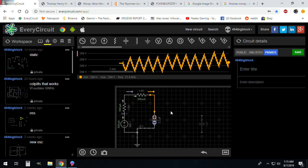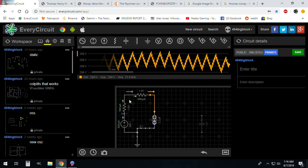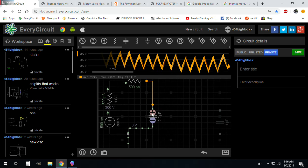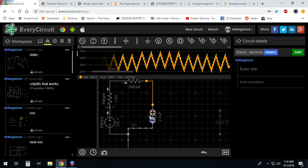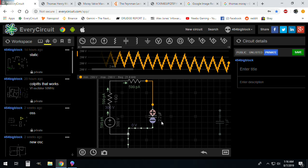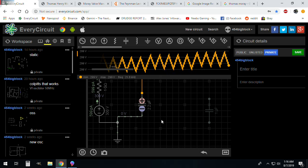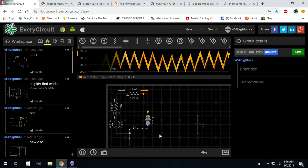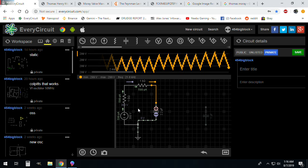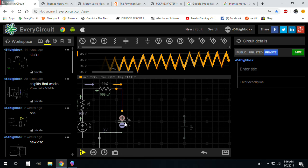Well, that's not accurate, because this amperage is so low. This capacitor here in real life would take a really long time to fully charge up. I think I did some testing and it would take like 30 seconds or something really long for a 2.2 uF at 300 volts. So this is going to take really long to charge, but I propose that we take a fairly big one like this and stick it as the main one.